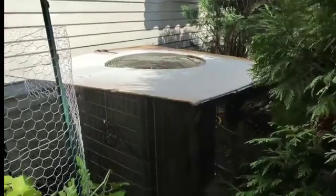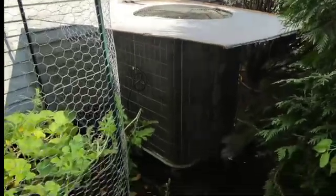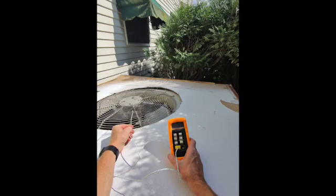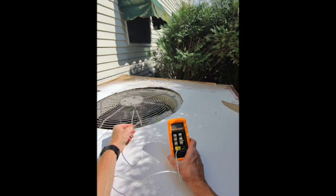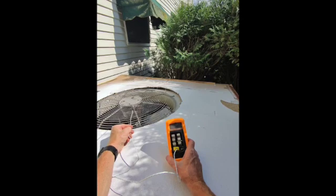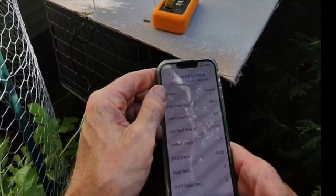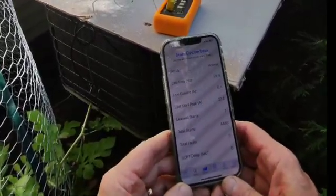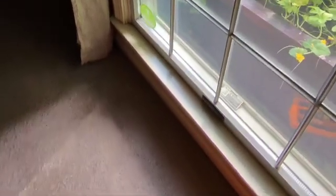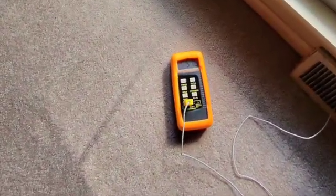This is what I came up with — just a simple cardboard piece with a hole cut out in the middle so the air can escape the top of the unit while leaving the bottom part in the shade. We're going to let that go for a few minutes and then start measuring things. With the cardboard covering most of the unit except for the fan shroud, air coming out at the top is 92.7–92.8 degrees. With the shade on, the live current is 8.8 amps. Inside at the register, the temperature of the air coming out with the cover on and no misting system is 57.6 degrees.